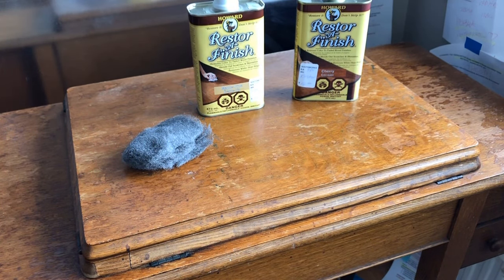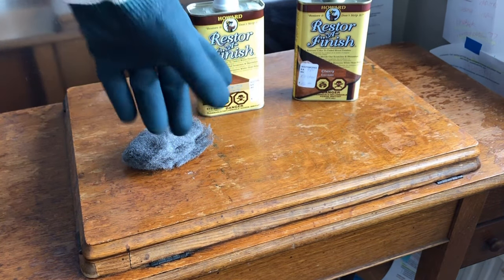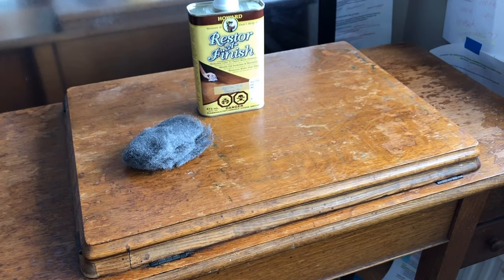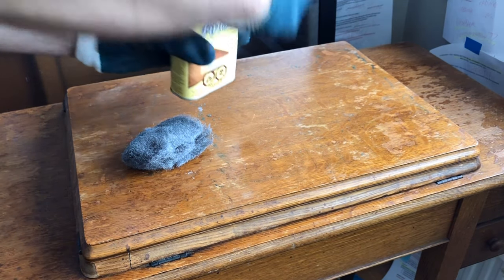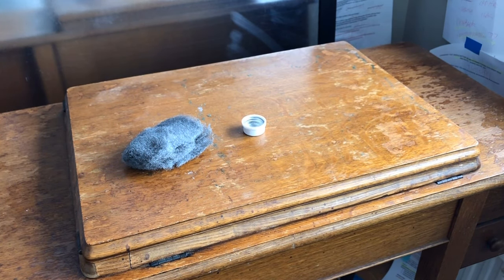We're really looking at the color — what color do we want? The mahogany table I have, it just so turns out that the mahogany color in Restore Finish was very close. So think less in terms of what kind of wood you have and more about the color of the wood, then use the colors within a product line like Restore Finish to gauge what you're going to need. I'm going to start with maple pine. This stuff tends to look darker when it goes on, and if I need to I can move to the cherry color. Keep in mind this is about a 70-year-old table, and a lot of woods and their finishes typically darken over time.